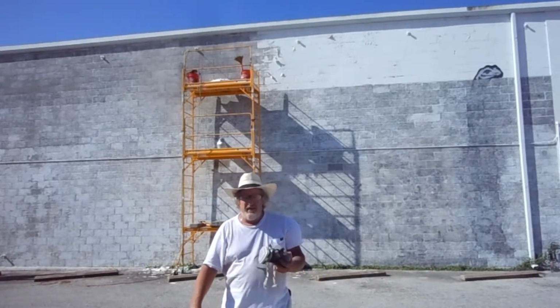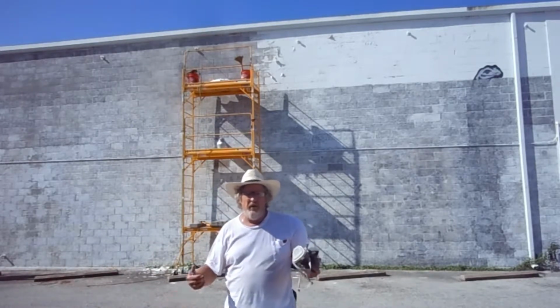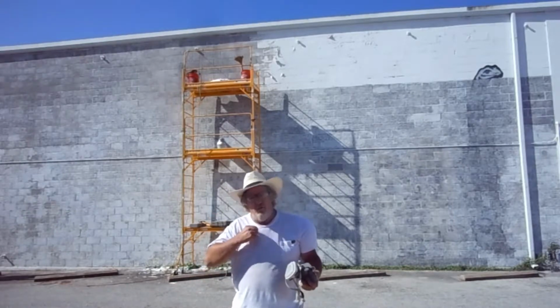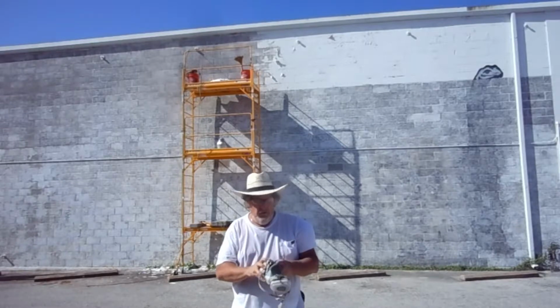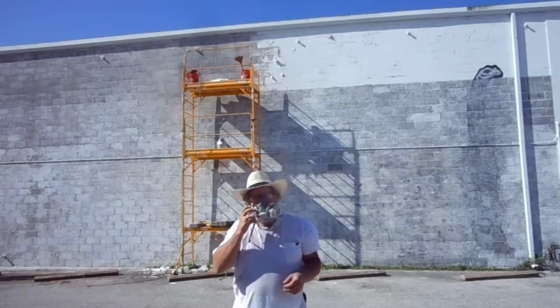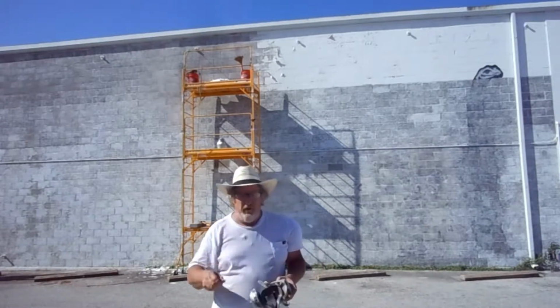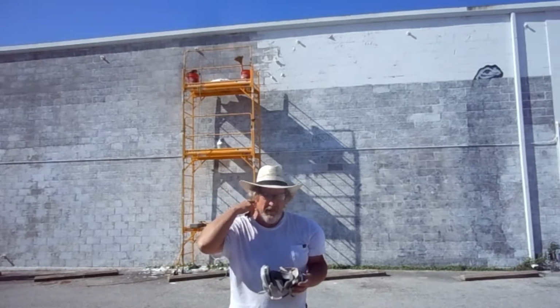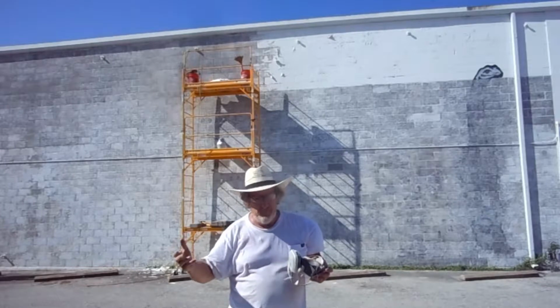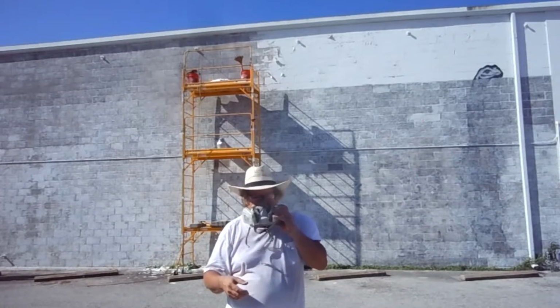Well, I might take a minute to talk to you about what I wear when I do this. We're all white, so it reflects the light. Stay a little bit cooler that way. And a respirator. When you're grinding and scraping the paint, a lot of that paint has lead in it. It's been there for 60 years, so don't get it in the lungs.